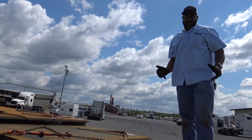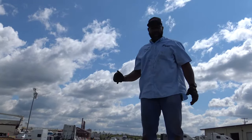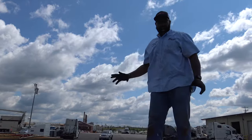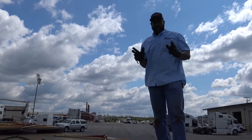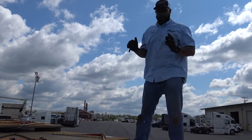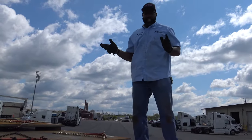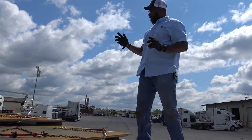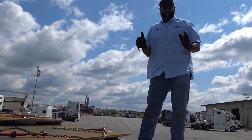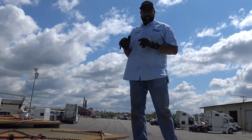Now I've got my X-Chain on the top layer on the front end and the back, and I've got X-Chains on the front and the back of the bottom layer as well. Anytime you're hauling plate steel, you want to definitely stop it from going forward and rearward. I used a total of eight chains to do that. And I'm going to put my other two chains across the top, then add straps as well to have more securement on top to meet the working load limit.